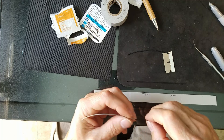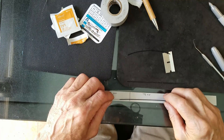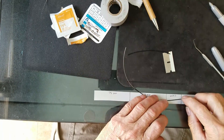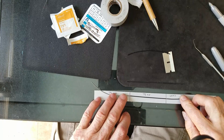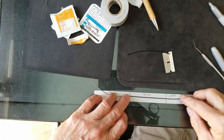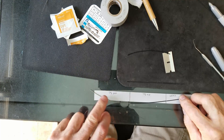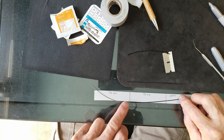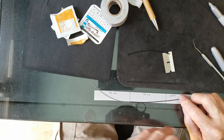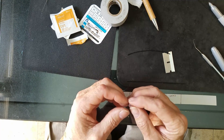Now we have the exposed ground shield and we didn't damage any of it. Come back and lay out the cable again to confirm we're at the 78 millimeter mark. We're a little long here, but that part doesn't really matter yet — what matters is that at the end you have exactly 78 millimeters of ground shield rolled back down over the lead.